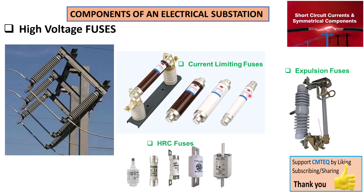How do these high voltage fuses actually operate? The operating principle is not far from a simple fuse. Under normal conditions, the fuse element basically conducts current smoothly without any problem. If a fault current arises — like the situation where the pole-mount transformer was on fire — the fuse element will heat up and eventually break the circuit to stop the flow of current. That's basically how they operate in simple terms.